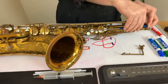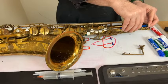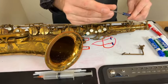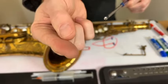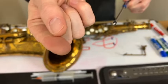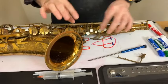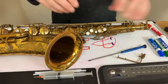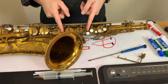All I'm going to do is just hold this and then turn. The cutting direction is as if you were tightening a screw — righty tighty. A couple quick turns, and I didn't take a lot — just a little bit. There is some brass dust there. It's best to take a little bit, put it back in, check it. If it still needs a little bit more counterboring, you would go back. You may need to do a little bit on both sides.